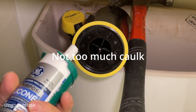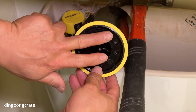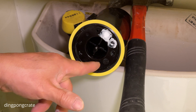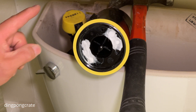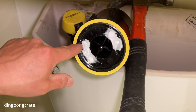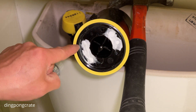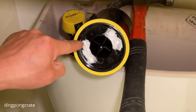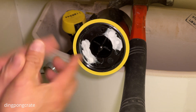All right, let's go ahead and do this right now. I am going to smother the holes. I'm going to repeat this for all the holes — one, two, three, four, maybe five; it all depends. So what I have done is plugged up holes one, two, three, four, and I decided to do one more for five. Depending on your toilet, five might be stretching it too much, so you may need to adjust. If it flushes too much after, you can take it out. But for my toilet I am doing five holes. Let's go ahead and put it together — it does look good, so hopefully this will do the job.